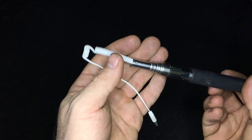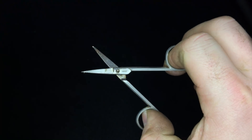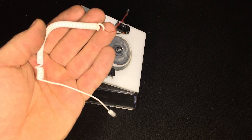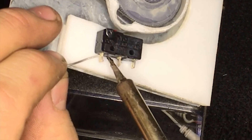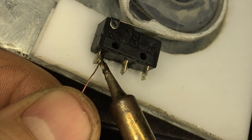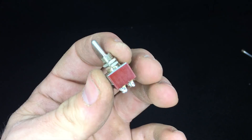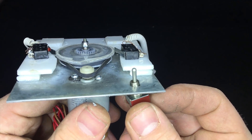I took this selfie stick, opened it up, and took it apart to reveal the cables inside. This is a very long cable — almost one meter long. I cut both cables, one at eight centimeters and one at about 20 centimeters. After revealing the copper cables inside, I solder them using a soldering iron to the normally open contact of the switches. And this is how the project looks like until now.